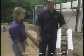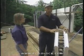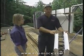And there's rebar that goes right up through here, too. Rebar also goes horizontally. So this is a strong structure. Yes, it is. And it has an R-value in it too. As this block stands right now, it has an R-value of about 22. With concrete in it, concrete gives it the thermal mass — it can push it up to about R30.